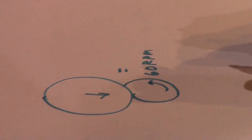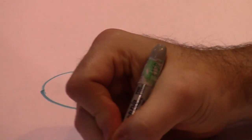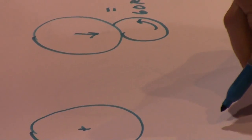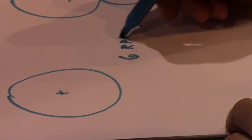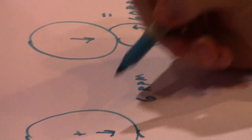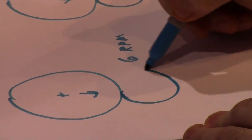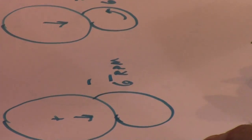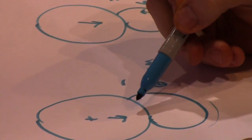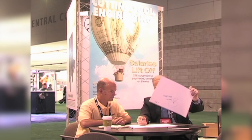Now, let's say I can either slow things down or speed things up. It's a round wheel again. Let's say now, instead of 60 RPM, I go 6 RPM. I'm not saying you should go 6 RPM, just for the sake of explanation. If we go 6 RPM, the wheel's still plunging at the same speed, so my depth of cut is going to be monster size because I'm going so slow. Every time that workpiece makes one revolution, the wheel has moved down how much? Over here it was 0.1 millimeters. Now we're up to 1 millimeter. That's a little extreme, but you get the idea.